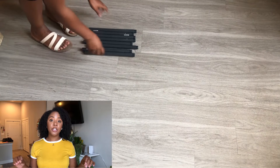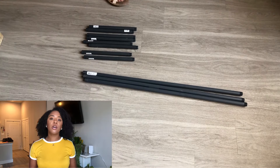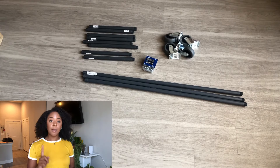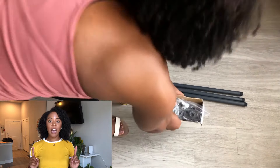Here's a list of the things that you will need — I got all of my stuff from Home Depot and I'll link it down below. I used one 1x10x10 piece of wood, I believe pine, cut into three 40-inch pieces. Eight half-inch by 12-inch PVC risers and three half-inch by 36-inch PVC risers. You'll also need four rolling casters, a box of number 10 by three-quarter-inch wood screws, some wood stain, some spray paint, 18 half-inch iron flanges, and two half-inch elbow joints.